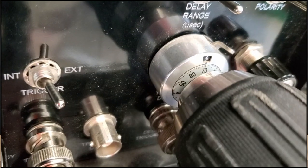We'll start with a natural or unfocused beam. Here we've got one coming in straight at 55 degrees — no steering, all the elements firing at once. Two things to note: the wavefront is really flat, and it's really big — and that's going to happen with an unfocused group.